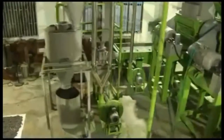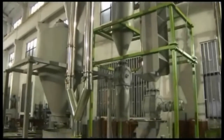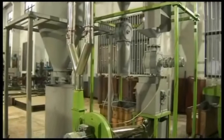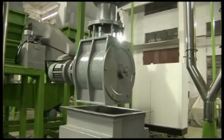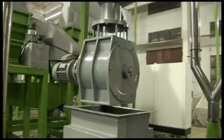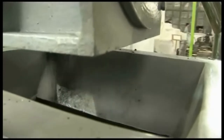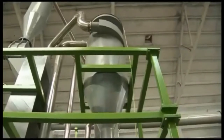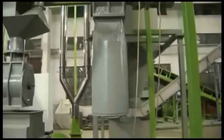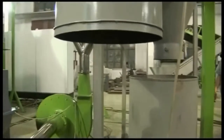These slender steel pipes are the air transfer system — the crumb rubber moves to the bagging station through them. Here is the second magnet; we use it to clear the residual steel in the crumb. This is the fiber removal system — it can separate the tiny fibers from the crumb into the air transfer system. Look at these tiny fibers, just like snow at Christmas.